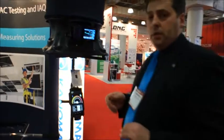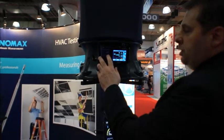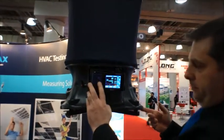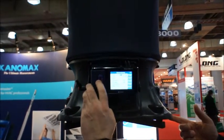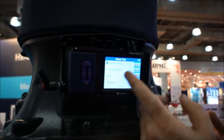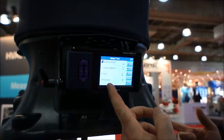Lastly, the unit can be used strictly as a micromanometer for pressure. You can put it into pressure mode and read across filter banks, take static readings off of ducts. You can very easily select through the menu for capture hood, velocity matrix, pitot tubes, or just using it for direct pressure readings.